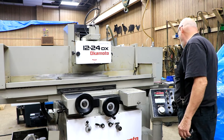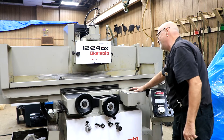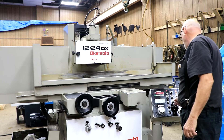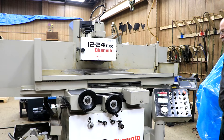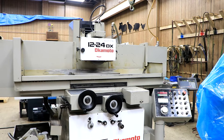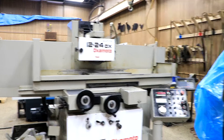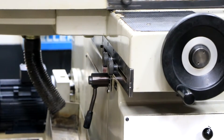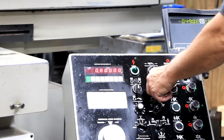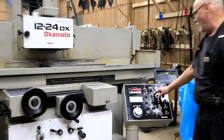Then you have to open this up a little bit and give it a direction. So there you have your cross-feed traveling. Now there's a set of dogs over here on the left side that you adjust the length of the stroke. You can also come over here and change it anytime you want, start coming back toward you, and when you put it back in the center, it's going to reverse with the stop — so you can kind of override it.